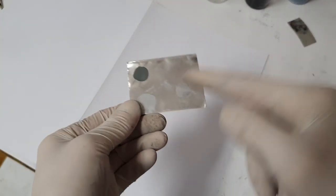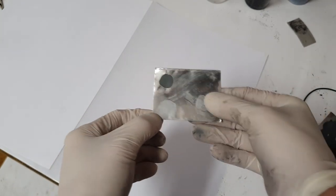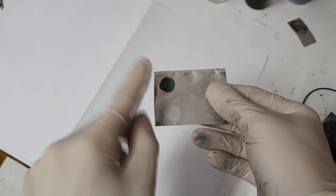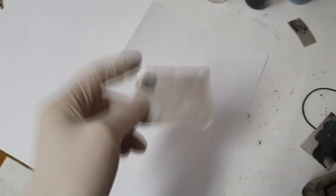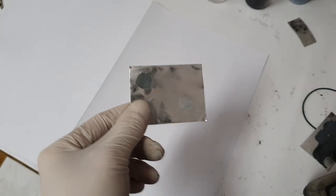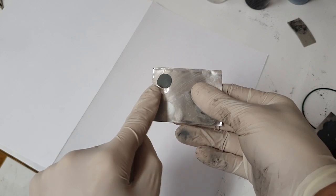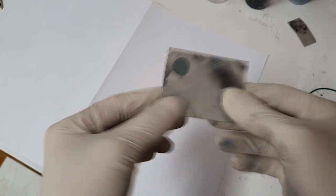In this experiment I put some drops of only potassium hydroxide on one side and you see zinc forming some oxide, but here I dropped the electrolyte which was potassium hydroxide together with zinc oxide and you can see zinc plating on the aluminum surface. I think I put too much zinc oxide into the electrolyte and got strong zinc plating on the surface of the aluminum, but because of this I got another idea.